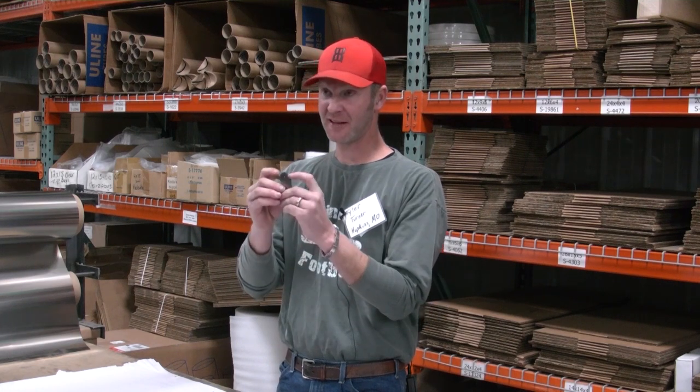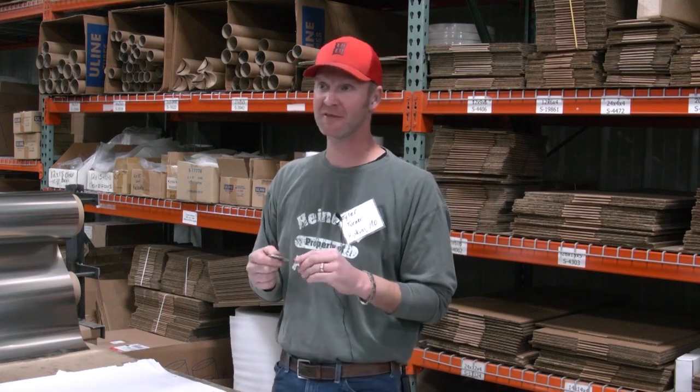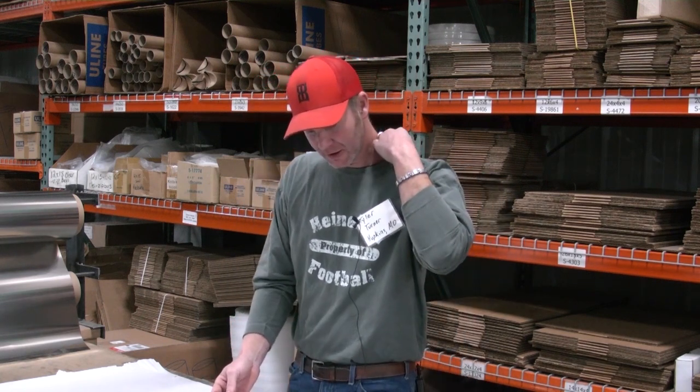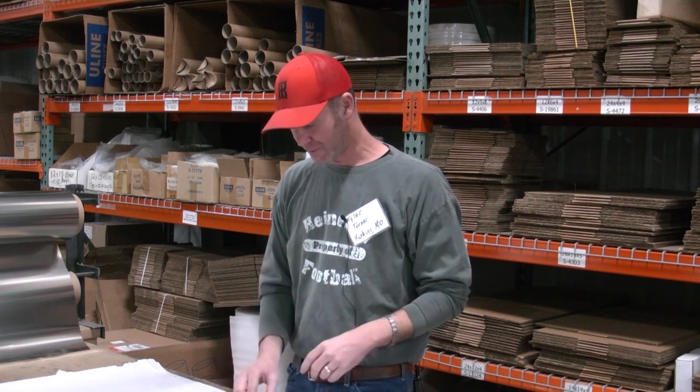That's crucial, because you'll get excited to go try to set the detent, and then you'll clean these up later, and then your detent will be junk. It'll wipe out everything you just did. Then you're starting over again, or you're making step stop pins, and that ain't fun. So after you get out of heat treat, go ahead and clean up the locations, and then you're ready for cutting your lock bar.